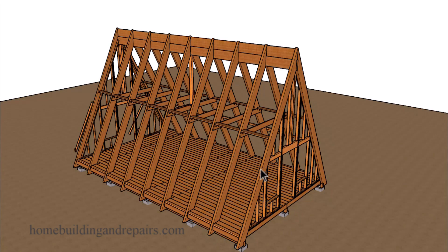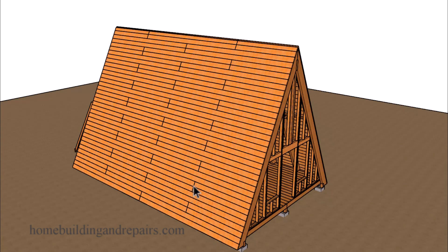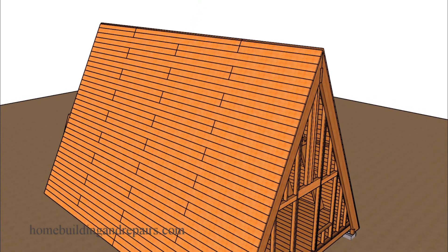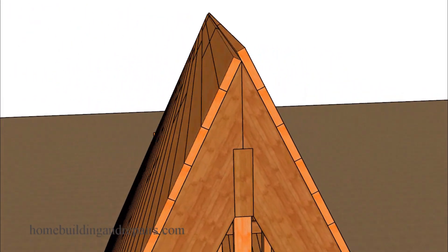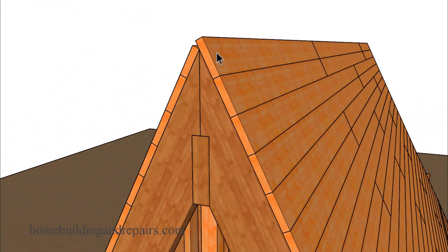You could always install more than one brace at different levels, especially when dealing with longer roof rafters. And this is what I meant by the double board spacing for the roof sheathing — we're going to have two boards on the same break, and then another two boards, and then another two boards. You could use this method for the floor sheathing as well, and probably won't have a problem with it. Here's another example of how you could finish off the ridge with the sheathing.